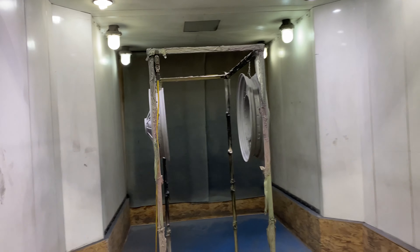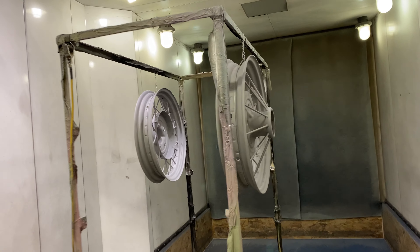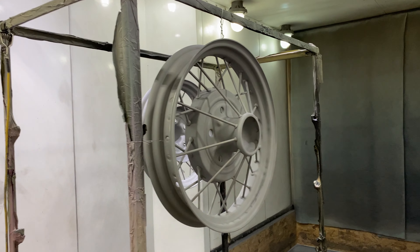So how is it done with the wheels — is primer put on first? I can if the customer wants it. What do you normally do for wheels? Normally I just do a color coat. The primer is more for stuff that's going to be out in the weather, salt water environment, stuff like that. It's epoxy based and most of the powders are polyester based.